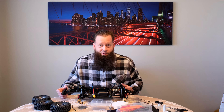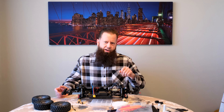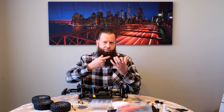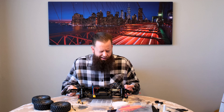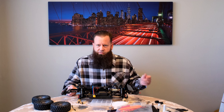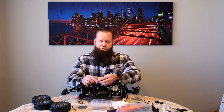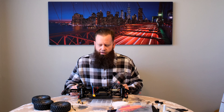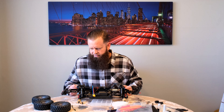I've got to find my soldering iron — it's been a while, like ten years probably. I have a soldering station at work where you can set your temperature and everything. At home I don't know where it went. I know I have one of those gun ones that's cold and then you pull the trigger and all of a sudden it's a million degrees. I'm trying to find my soldering iron that's a little more precise, otherwise I'm going to have to borrow the one from work, so I don't melt the connectors. These battery connectors I've soldered before and the whole case melts on them before your solder melts. So you want pretty precise control of your temperature, in my opinion.